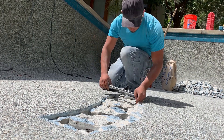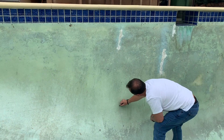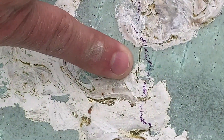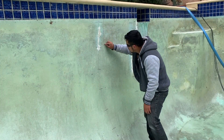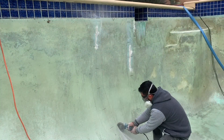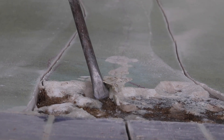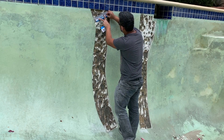What we're doing is we map and mark so that we could see all our cracks in this pool. It wasn't too hard to do because they were previously repaired with what we call bubblegum epoxy. Once we mark everything out, we mark the staples every foot, then we cut wide, chip everything out.